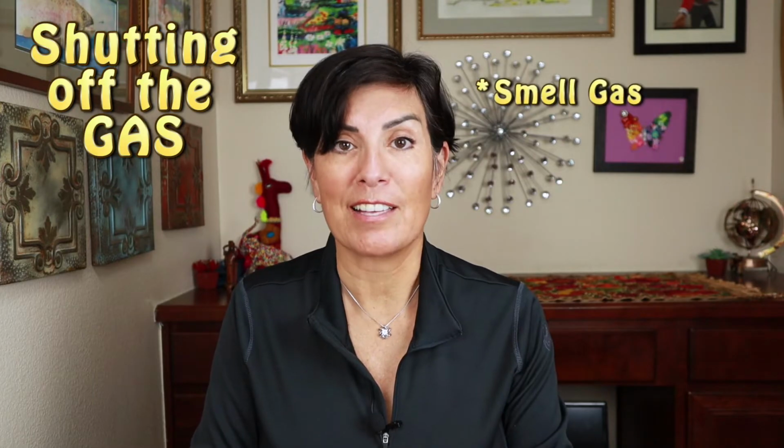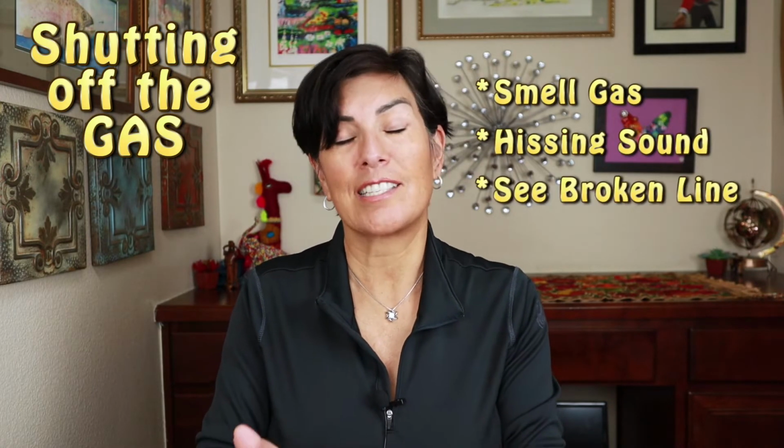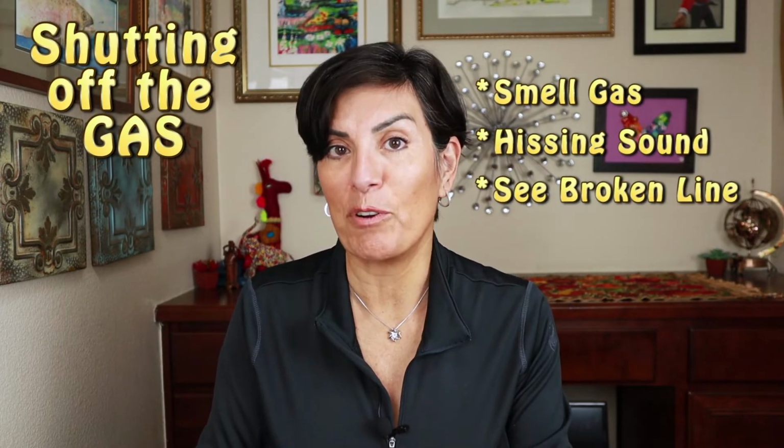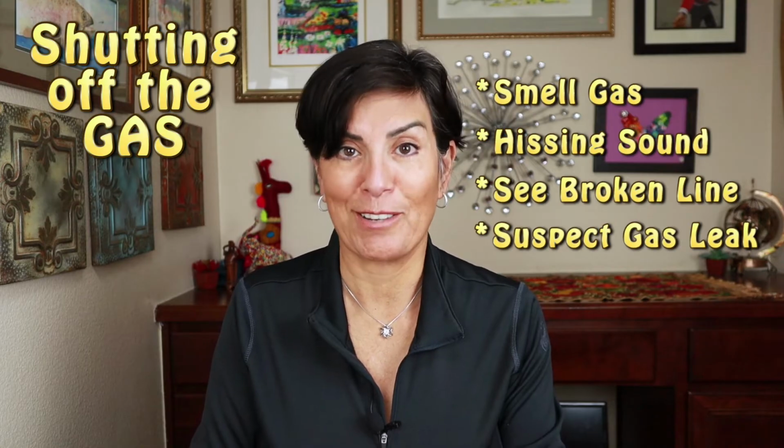Natural gas is often used to heat your home, give you hot water, and it commonly powers ovens, stoves, and dryers. You probably have it. Even if a disaster hasn't happened, if you smell gas, which smells like rotten eggs, or you hear a hissing sound, or you actually see a gas line broken, or you even suspect a gas leak, you're going to want to shut this down to your house.